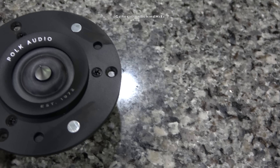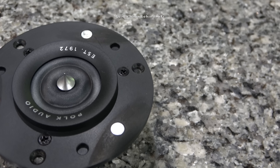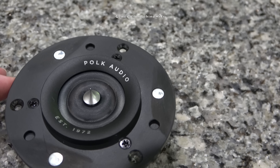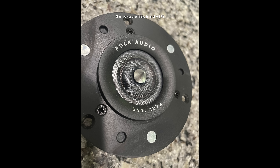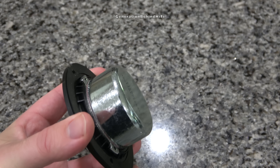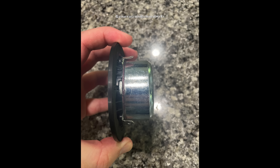The R200's high frequencies are handled by a one-inch pinnacle tweeter — a ring radiator designed by Polk. The point in the center is a waveguide designed to enhance dispersion of high-frequency sound waves. Unlike traditional dome tweeters, the pinnacle uses two large soft ring suspension pieces as the acoustic radiating surfaces — an inner ring and an outer ring — so breakup modes are less of a problem because there is no central dome. This tweeter also features a well-damped sealed chamber to reduce resonances from back wave radiation. To reduce inductance and flux, Polk uses a copper cap on the tweeter, which improves clarity and reduces distortion. The speaker terminals on the back are made from non-ferrous materials.